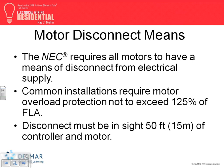Disconnect, as you guys know, this is where your disconnect has to be within sight and not further than 50 feet. Anybody know why 50 feet? They brought the slowest, the least moving individual electrician in the state of Minnesota, and they said, how long will it take you to go to the disconnect there? And based on an equation, they discovered that 50 feet is good if there's an emergency. That's my interpretation. And that's not DJ. Union. Well, we're not going to go there.